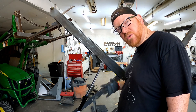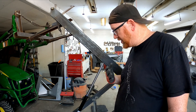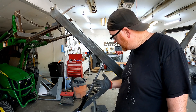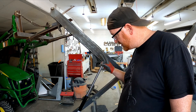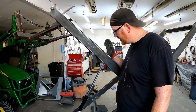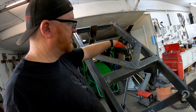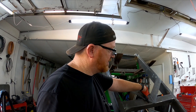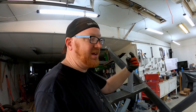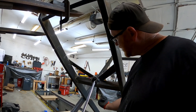The reason I wanted to change the angle is this was resting further out, which left a lot more leverage that this was going to have to lift. I wanted that hydraulic to have all the advantage it could. If we're going to have 3,000 pounds of force and this is halfway to the distance, we've got about 1,500 pounds of lifting capacity at that point. It's definitely a lot of finicky measurements — you change one thing and you get a big change. Hopefully this will still give us the ability to lower the weight of a motorcycle down into the pit. We still have the ability to upgrade the strength of this ram or potentially even go to two rams in the future.